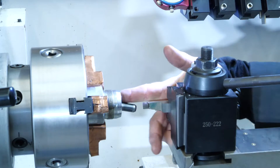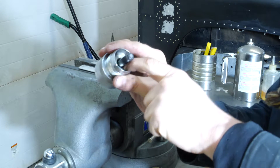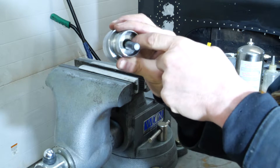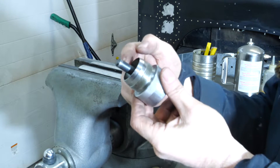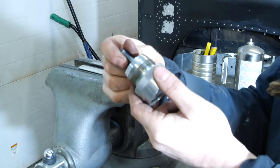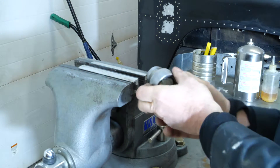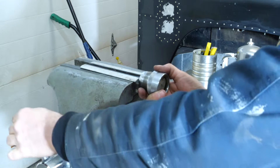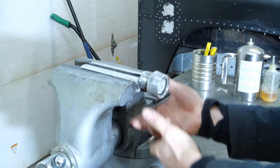After machining off the pinch distortions that held the washer in, I tried to pull this pin — which I suspected is mushroom-shaped or has some hardware on the end — just with my fingers, but I can't. So I'm going to clamp the pin in a vise with rubber soft jaws so I don't damage the pin, and now I'm going to pull.